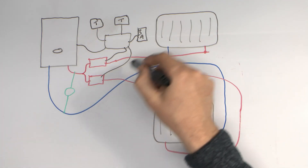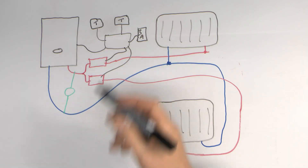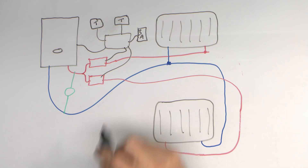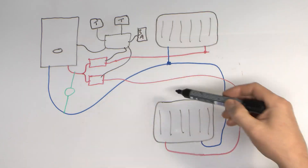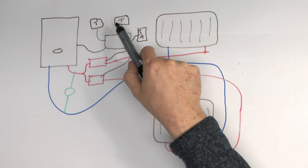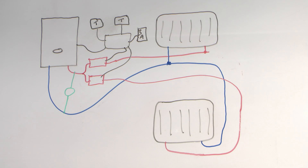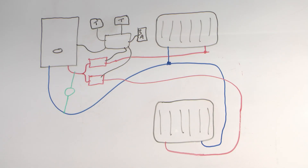What you do not want is a cable going to the boiler and then another one going to other parts of the system, because that could result in turning something off without disconnecting all of it, which would be obviously dangerous for people who have to work on the system or service the boiler. In terms of thermostats, they could either be permanently wired-in items, or more commonly these days just a radio receiver unit. That also covers things like the Nest and Hive and all of those smart things which are fairly popular now.